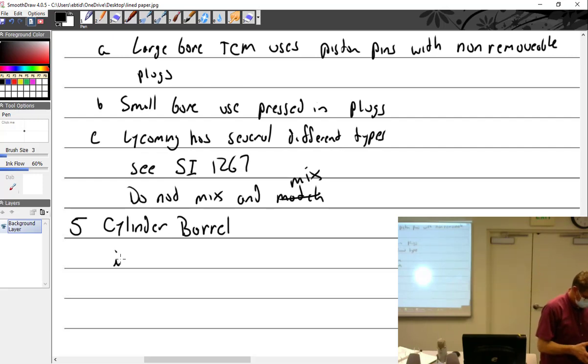And in fact, in my shop, when we were working on cylinders and we heated them, one thing I didn't show you guys is we would always make an index mark on the barrel and the head, because when you're machining it and it's hot, you sometimes will twist them a little bit.